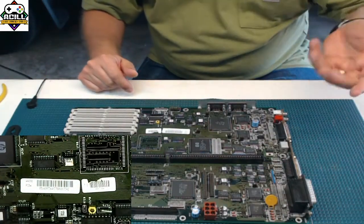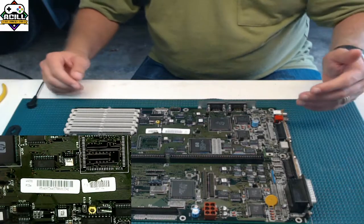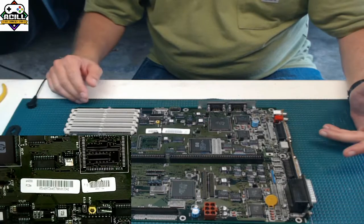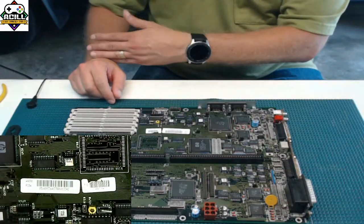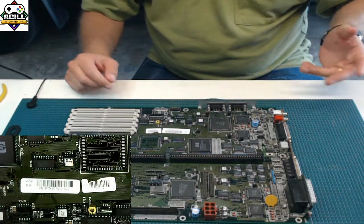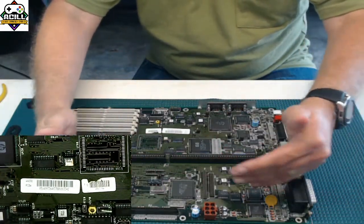When I worked at Intel, I worked on some of this equipment, repairing it. And you put your bead of solder paste or flux. They usually clean the boards first, then run them through and get a flux treatment onto all the pads, and then it'll actually run through the oven and everything, and then they'll clean the board off, and then they'll put the solder paste on.